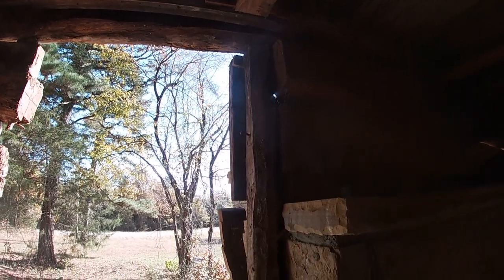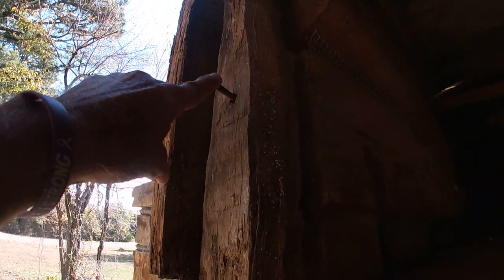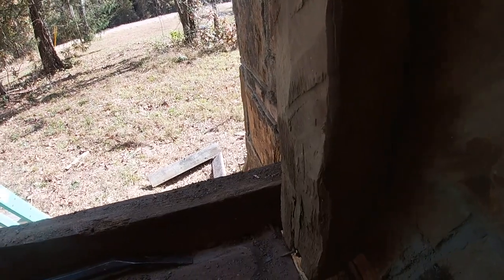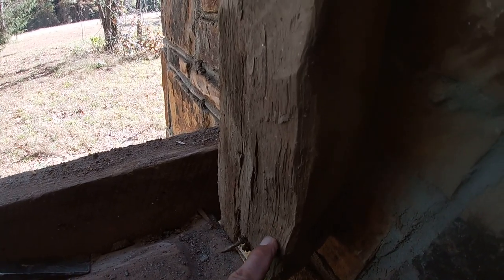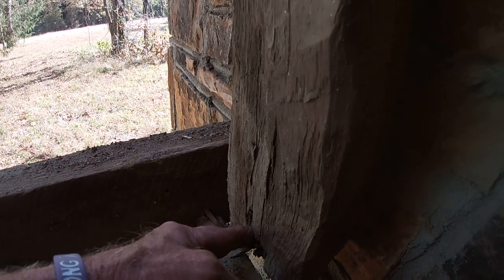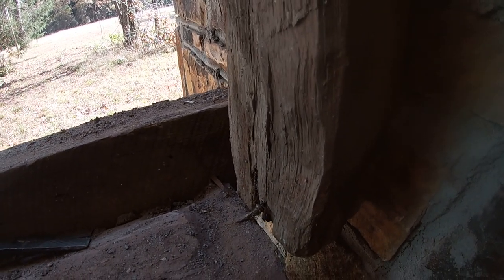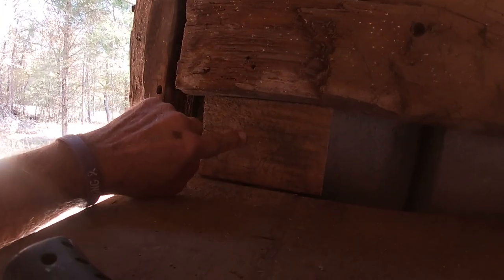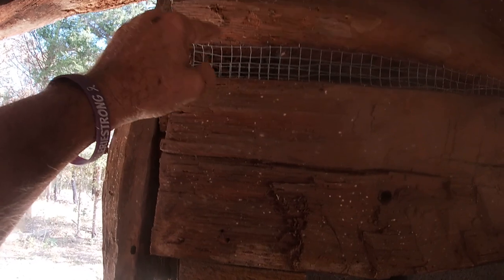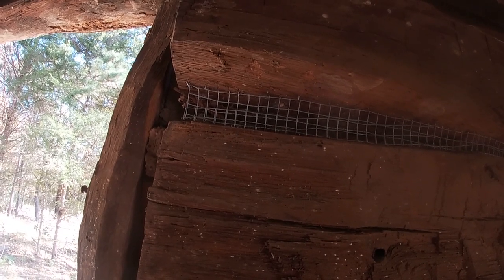Somebody has made this and put it over there — you can see there's just regular Phillips drywall screws holding those boards together. Now I've got the old window out. They did use a small timber and put it in there, but it's only held with what looks like about a 20-penny nail that went into this log. I'm guessing this upright timber actually sat on top of this log at one time. There's a square nail right there that was probably driven in, and when this slipped over it bent the nail. This log has slipped out close to three inches and the fireplace was built right up against it.